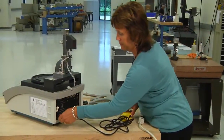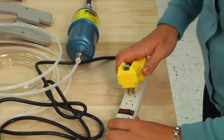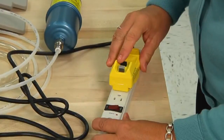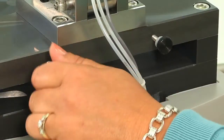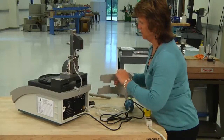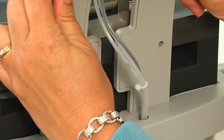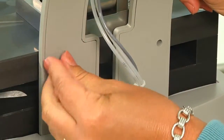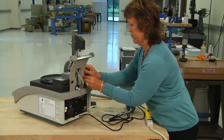Next, plug the electric cord into the back of your machine and then into your power supply. On this particular cord, you have to push the reset button to start the electrical current. The third step is to attach the cable management bracket on the back of the polisher. Remove the two thumb screws on the back of the machine and slide the cable management bracket over the drain hose supply and into the slots provided. Reattach the screws to secure.